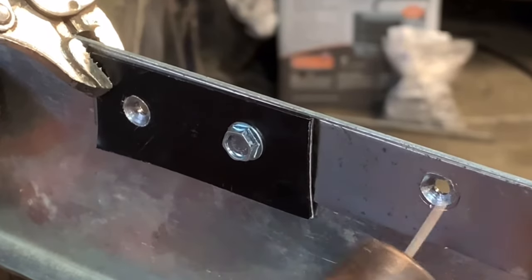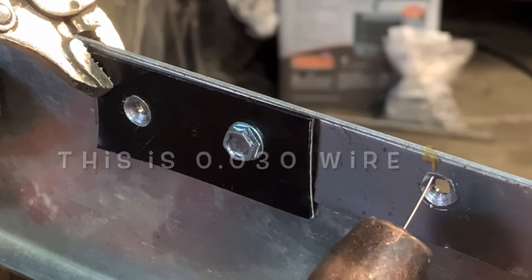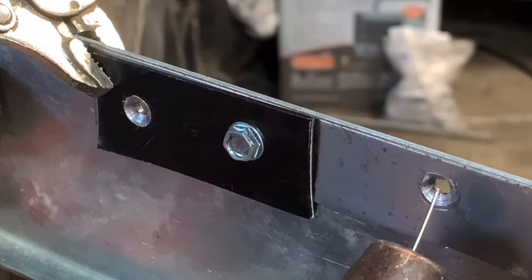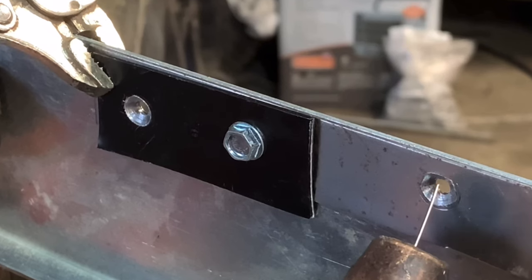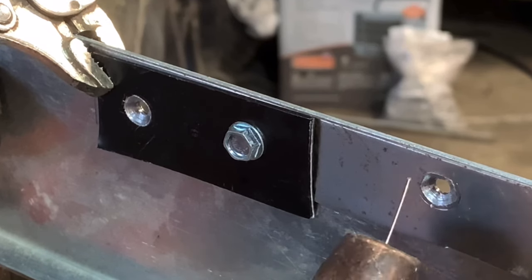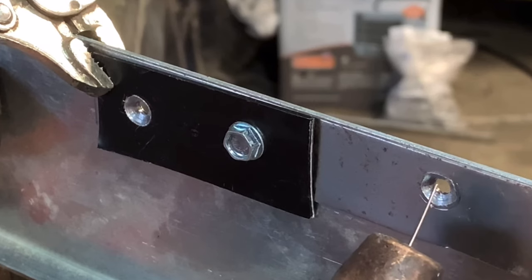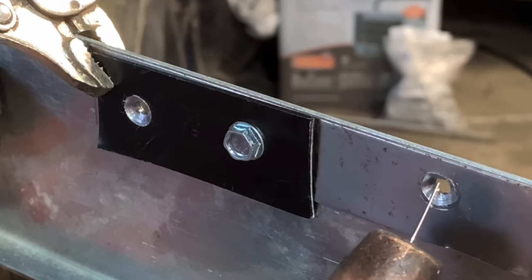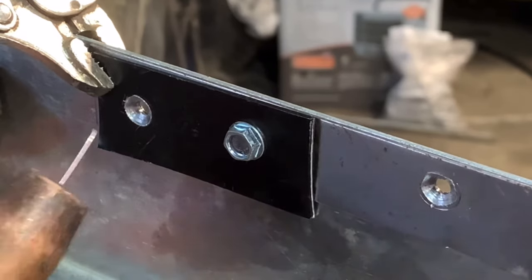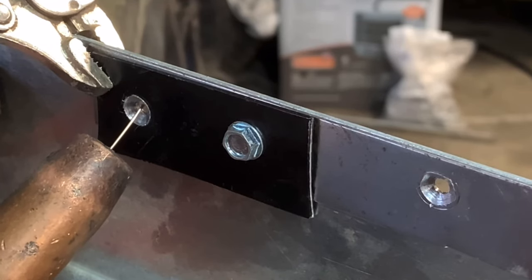I'm not actually going to weld at this time — I want you to see what happens. You see the wire? It's actually relatively small to the hole. What we're going to do — I'm not going to arc as you can see it — but I start at about the 12 o'clock position when doing a vertical line weld. Horizontal is a little different, you can kind of go any way you want, but kind of start close to the base of the circle and do a little circle. On a vertical face, since gravity seems to be your friend or enemy, start at about 12 o'clock. I kind of feed the wire in with the tip at about a 45 degree angle. Sometimes I'll do a circle depending on how deep it is, or sometimes I'll kind of go back and forth almost like an S, and then fill that thing right in. For three layers deep you've got to have a steady hand and start at the base of the hole. Four layers deep gets a little tricky, but it can be done.